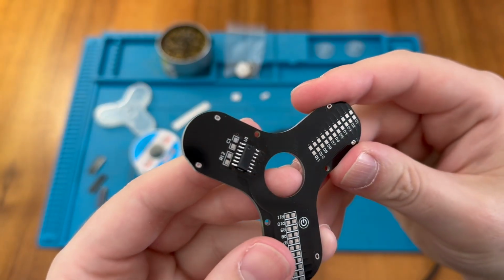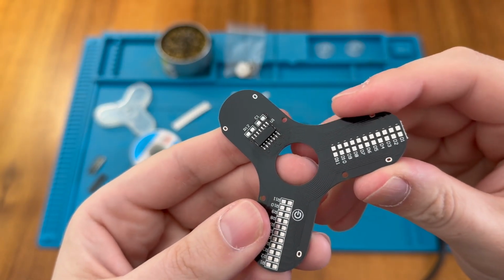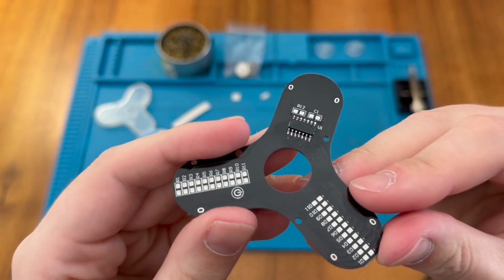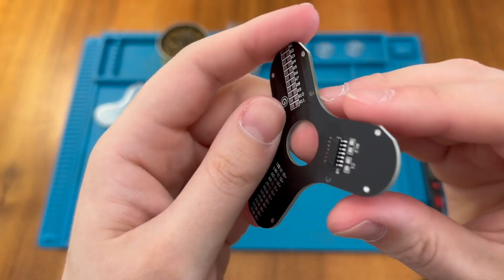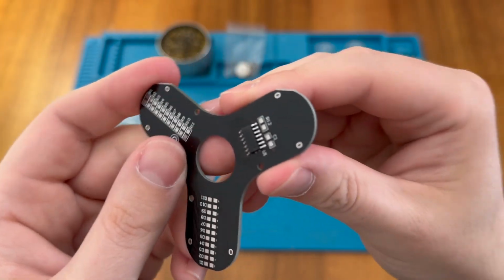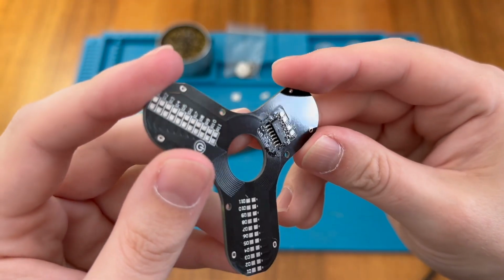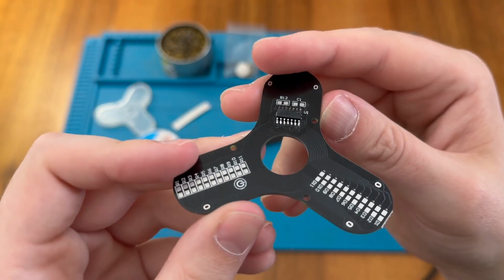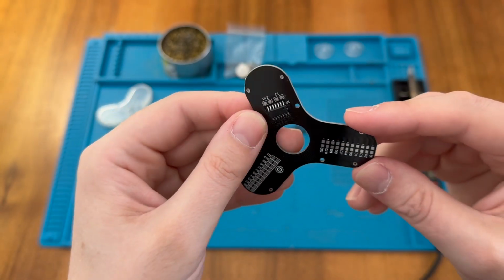Okay, I think these are all probably soldered reasonably well. We'll find out, I suppose, when we get to actually operating it. Maybe I could put a touch more on a leg or so, but I think these are all connected. This side in particular seems pretty good. Hopefully that's focusing for you. This side, a little bit less so, a little bit more crusty, which is why I did a little flux there. I did have a bridge as well, which I had to resolve, but hopefully that's all connected correctly.